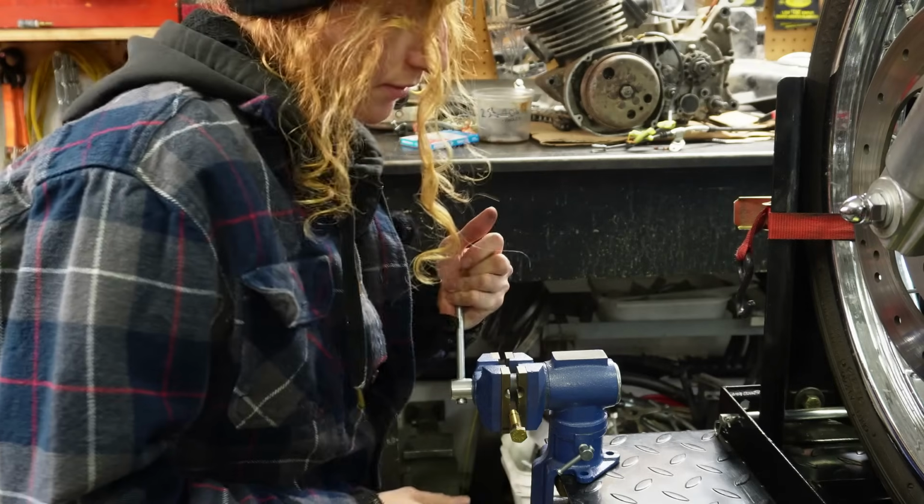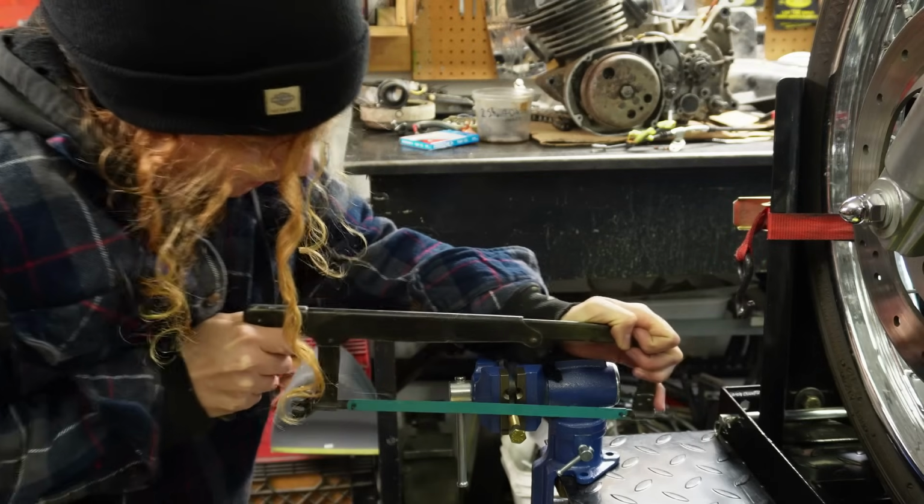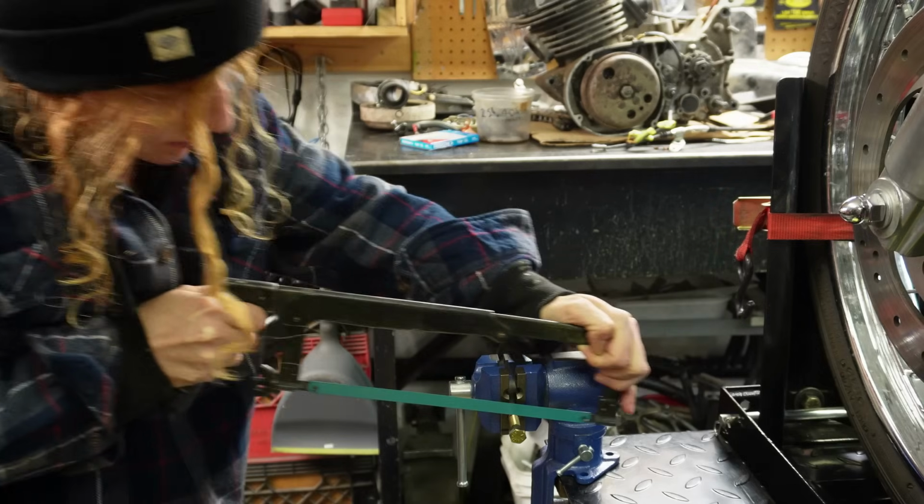So good old hacksaws. Every time I'm cutting bolts too, I always clamp the section that I'm not going to be using. Most critical part of the cut, because you don't want the saw blade jumping up into the part of the bolt you want to keep.